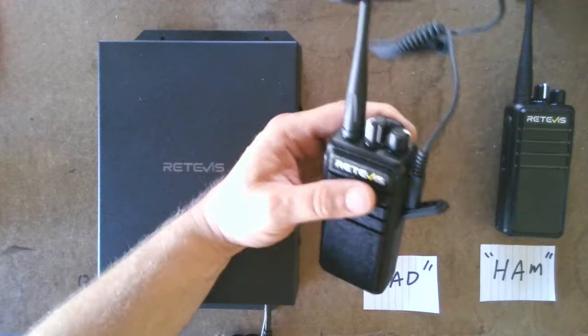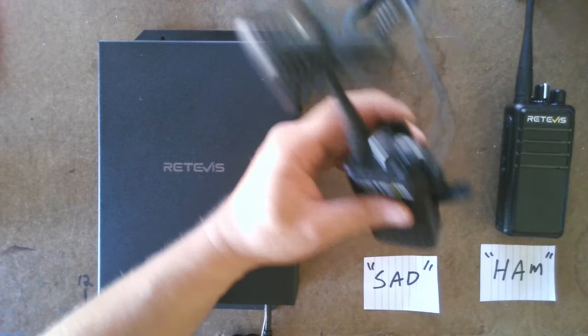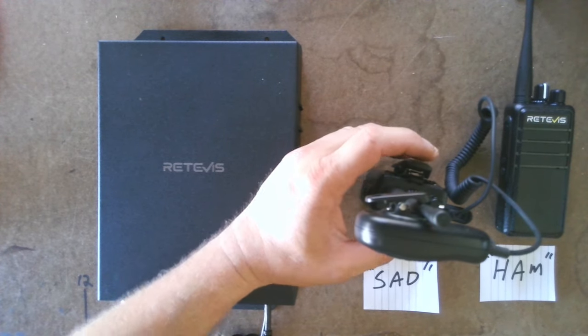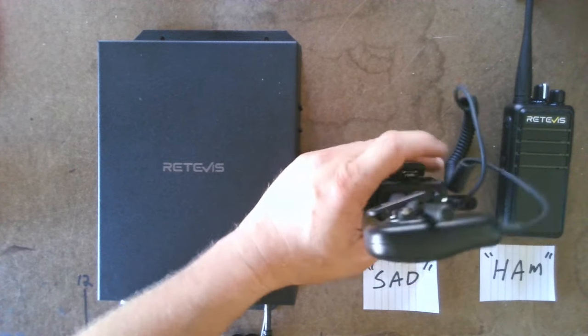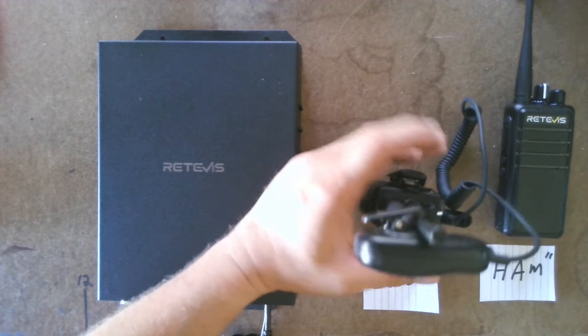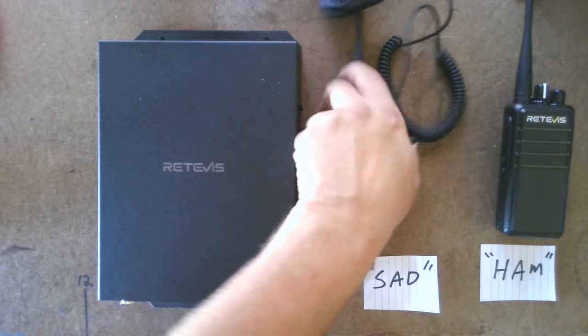You're probably thinking, how many channels can I program in here? Up to 16 in this handheld. Now you might think, if I have 16 different frequencies, the guys are going to bump them and not be on the right channel. Well, no — you could program all 16 with the same frequency. That way, no matter what channel they're on, they won't be on the wrong channel.